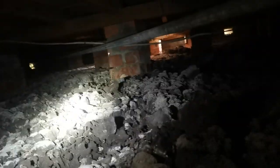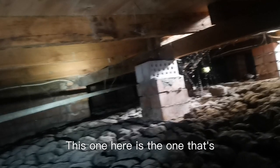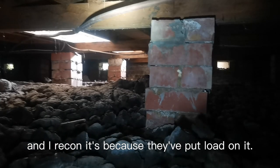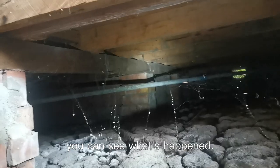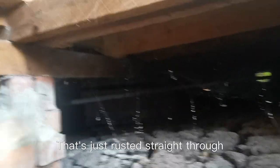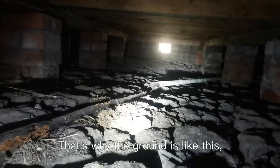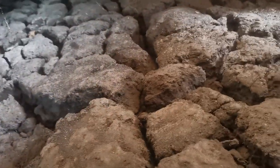It seems a little bit damp — the ground sort of looks wet but when you touch it it's not wet. This one here is the one that's going to have to be lifted up, especially right here. It's dropped heaps and I reckon it's because they've put load on it. It's all going to have to be lifted up a couple of mil. You can see what's happened — it's the old water pipe and that's just rusted straight through, and this hole underneath the house is filled up with water. That's why the ground's like this, because it got flooded and then dried and cracked like the desert. It's amazing.